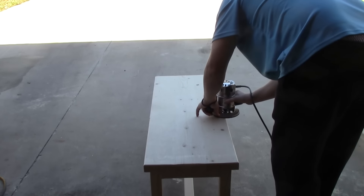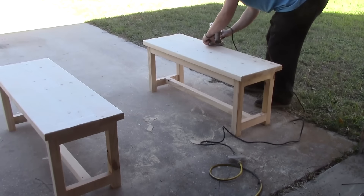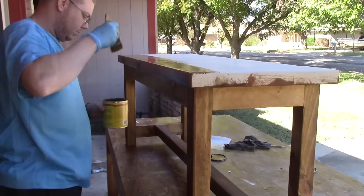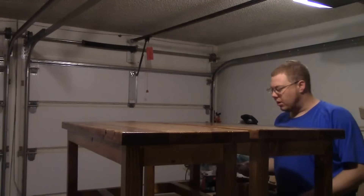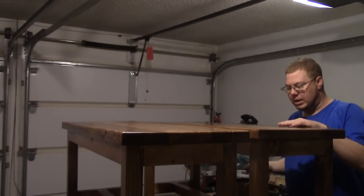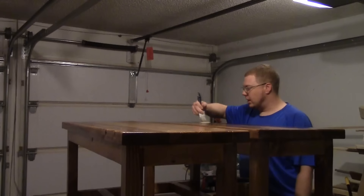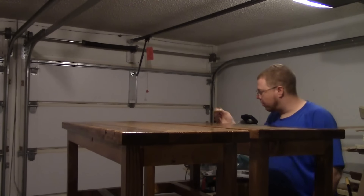Now a slight round-over with my router. After some final touch-up and finished sanding, it's time to go ahead and stain. I don't know how many coats I'm going to put on this — this is my second one. I put the first one on a few hours ago to dry, and it still has a little bit of tack to it, but it's dry enough that I can go ahead and apply a second coat. I'm trying to do these like I did on the table — as thin as I can so that I can apply them more frequently.